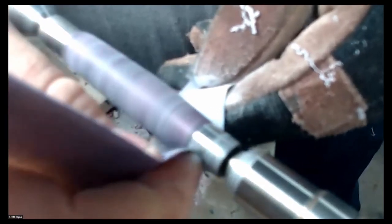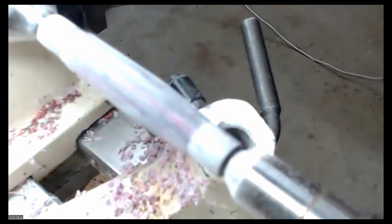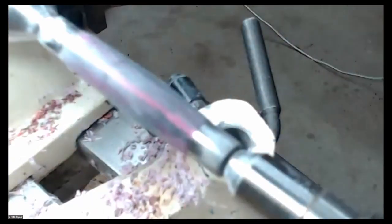And then I might take a little quick sand like that. You know, sanding, boring, but I'll show you my process. That's about all the sanding I do with the 220. Then I'll come back with 320 and run the scratches vertical along with the grain, just like running grain on a piece of wood. I'll take that all the way to 600. I'm not going to bore you with that because I have some that are already sanded to 600. So if you notice this pen blank, you can put some denatured alcohol on there.